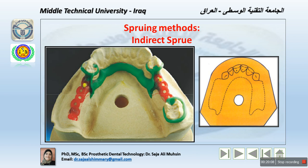Through the casting process, gas will escape if we do not use small vents. Sometimes we use these vents with the same cross section as the clasp, for example, connecting at different points within the casting, especially those with delicate design, to avoid the gas being entrapped in the end of the tip of the clasp with the retentive part. So we use these vents to let the gases escape through them.